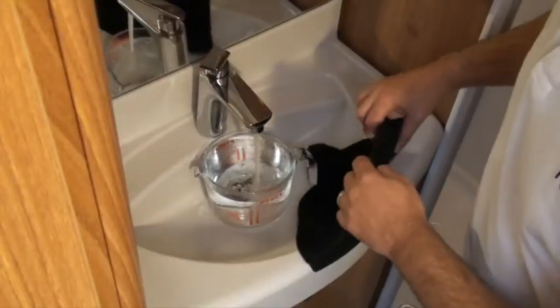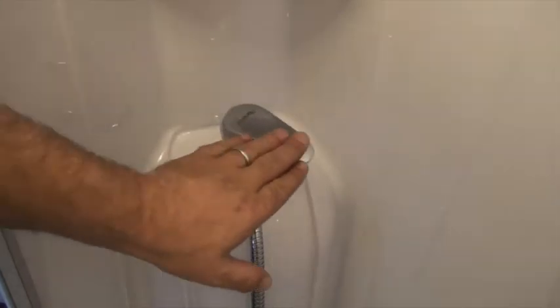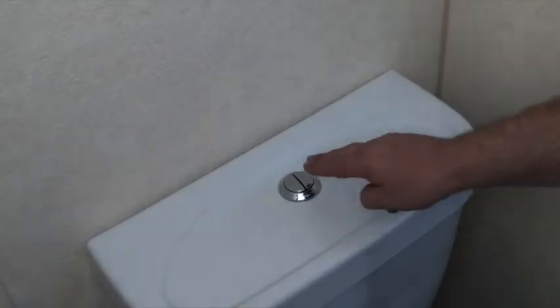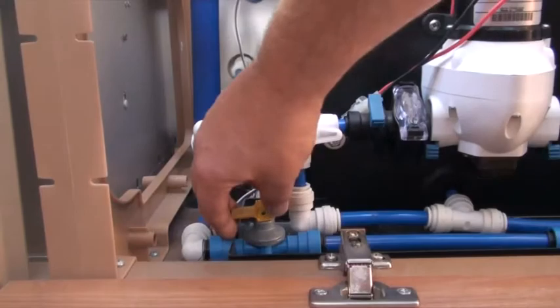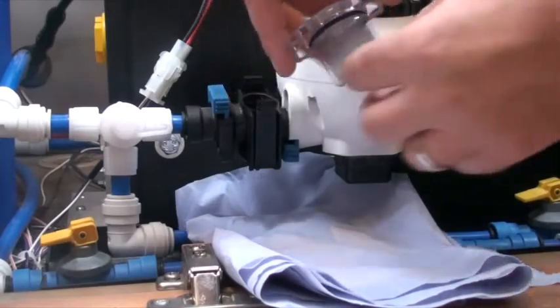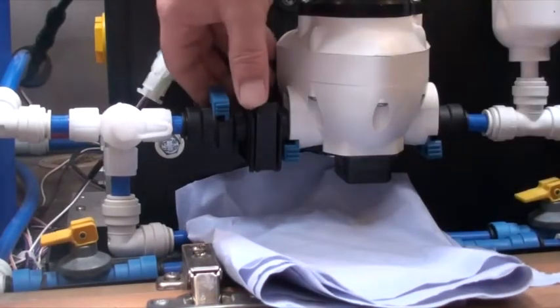Now that you've carried out the drain down, it's important to run through a checklist to make sure you've drained everything. Make sure you've drained all of the hot and cold taps in the kitchen, bathroom, and shower — don't try to drain both at the same time by leaving the mixer in the middle, as it's just not as effective. If you have a toilet connected to the main water supply, drain the electronic ones by pressing the flush button and the domestic ones by pushing the ball cocks or floats down — but don't flush them until the very end. Also drain the water heater and onboard fresh water tank, empty your filter in winter, and don't forget any outside outlets.